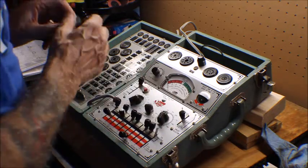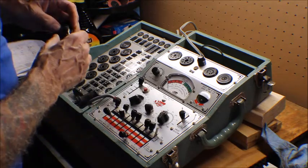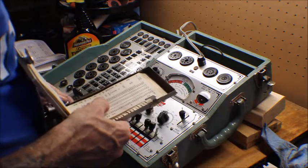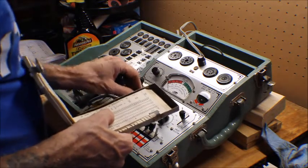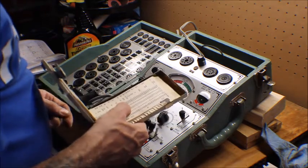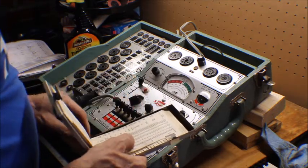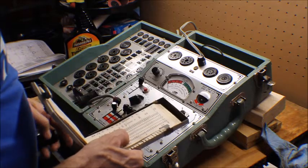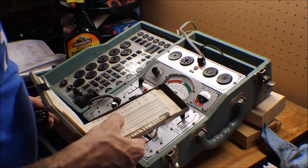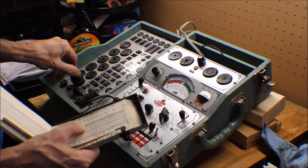Okay, now let's try the next one, the 12SQ7. Set 12 volts. Oops, let's put all these back. F is 7. F1 is 8. Q is 2. The load is 100%. And this goes in slot 8J, which is right down here.